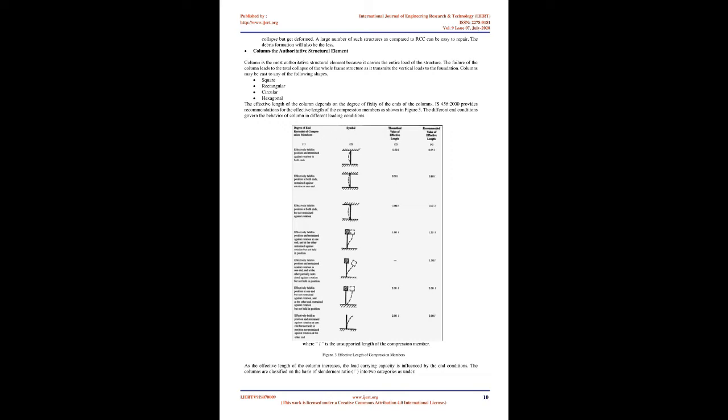Advantages of ferrocement technology. Ferrocement is an isotropic material up to 40% of the yield and its density is about 2750 kg/m3. RCC material is a heterogeneous material, density 2500 kg/m3, consists of voids and capillaries. Therefore, water and other gases easily entrapped in the concrete material which cause crack formation, spalling, and corrosion of reinforcement.